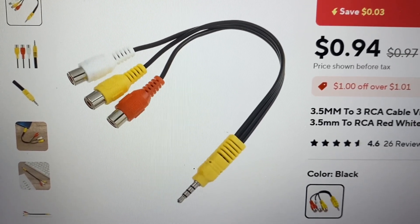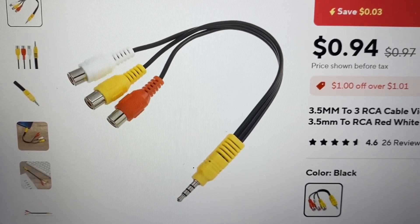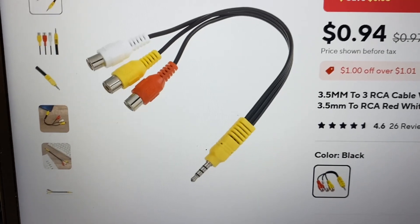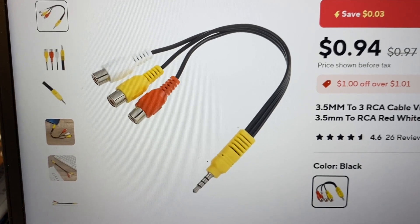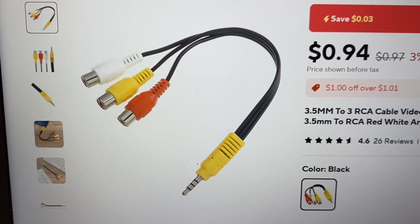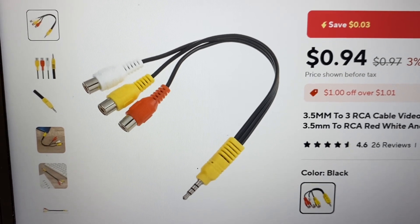On the back of TVs these days, if you don't see a set of RCA jacks you might just need a simple physical adapter. I was trying to connect a DVD player to a TCL TV — it doesn't have RCA jacks on the back, but it turns out you just need to convert to a 3.5mm jack with a simple physical adapter. I got two of these adapters from two different sellers, and they were both wired wrong, even though they were explicitly advertised for a TCL TV.